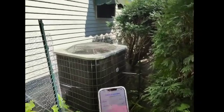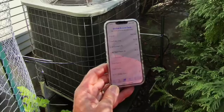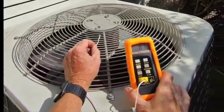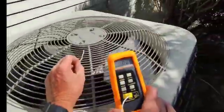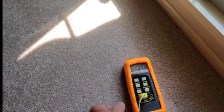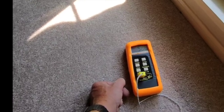Now we've moved the misters about a foot away from the unit and we're checking the live current. It's showing 7.9 amps — maybe a little difference. The temperature of the air coming out of the top of the fan shroud is about 87.3 degrees, and I think before it was something around 85 and a half, so that seems to have gone up with the misters having been moved out a little bit. Maybe they're too far. Going inside to measure the temperature at the register — it's steady at about 58.8 degrees with the nozzles moved out away from the unit by about a foot. It looks like that's also counterproductive.